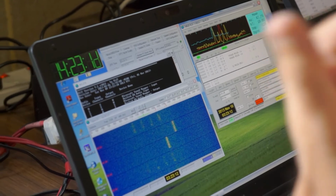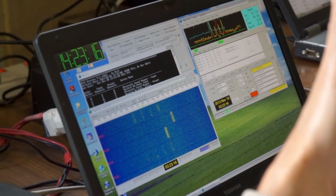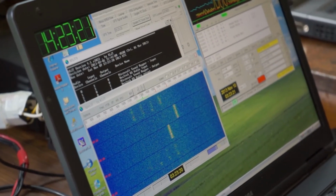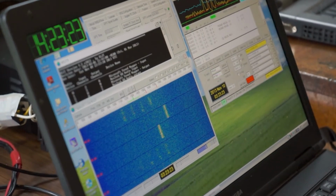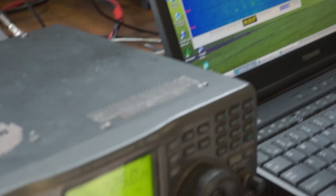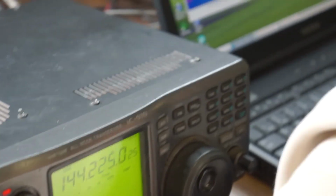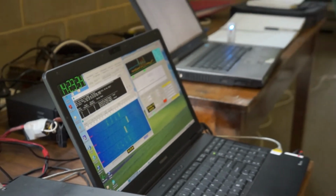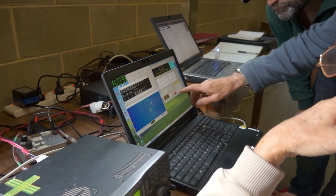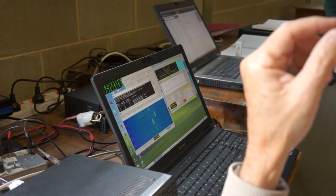So this knows when he stops transmitting. It does it on 2-minute cycles. We transmit for a minute, and he transmits for a minute. That's a fixed cycle, and the most easterly station always transmits in even minutes. Gotcha. And we're west of him, so it's just a time thing, not a space thing. If we wanted to transmit first, we would tick that to transmit in the first period, but because we're west of him, we transmit second.